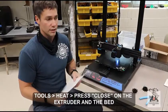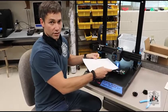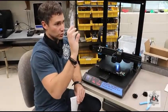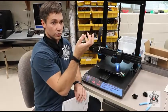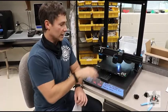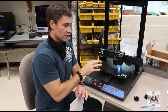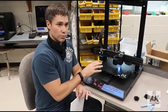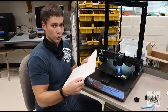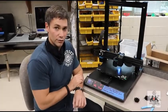At this point, that should be it. You're wanting a very, very firm pull resistance when you're doing your leveling, going all the way across the board, and you do very, very small turns — you don't do large twists of the actual levelers, very small increments. You do this two to three times as you go through. That's the leveling process — Sidewinder, but you can do it with other printers just the same way. You want a really tough pull with the paper, but not so much that it actually tears the paper. Thanks for watching, hopefully it's helpful!